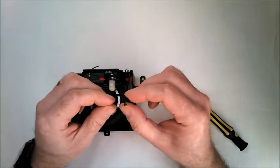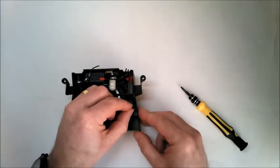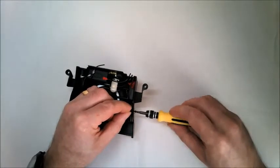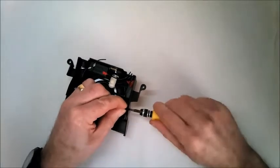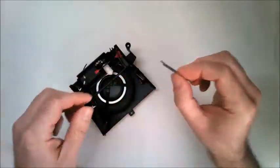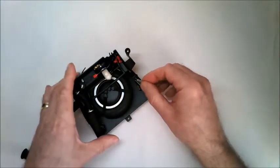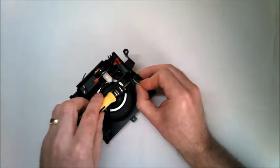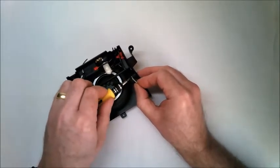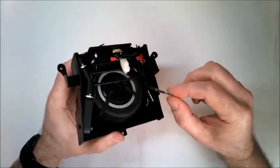To begin this stage, take bracket A from stage 72 and secure this to the side of the front compartment, and use a 4mm screw to hold it in place. You can then fit the bonnet stay from stage 72 to the bracket A on the inside. Tighten the screw in place, but make sure that the bonnet stay is still able to move.